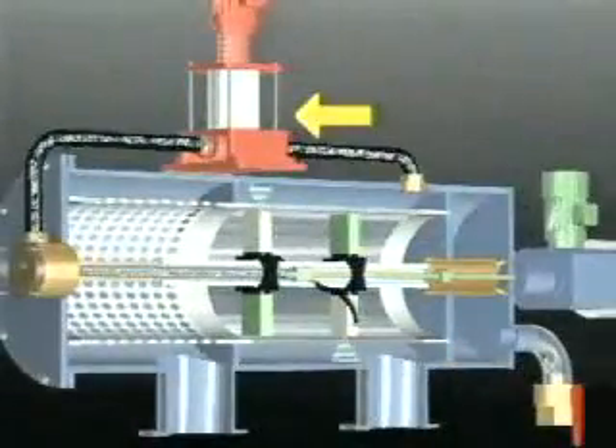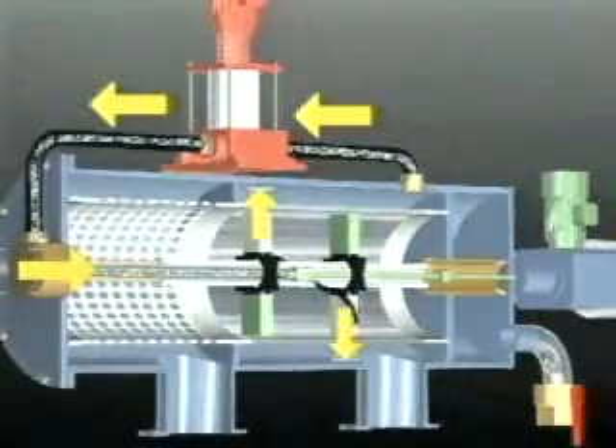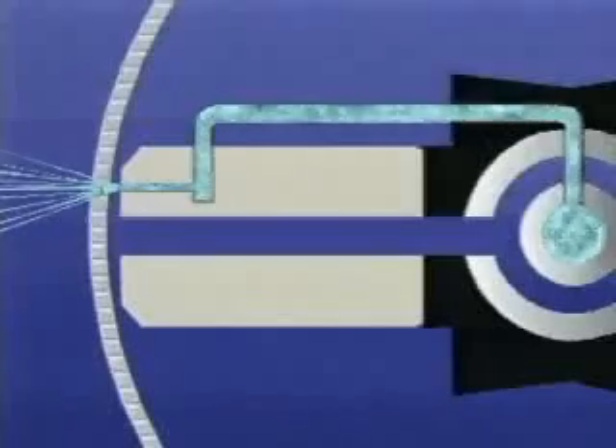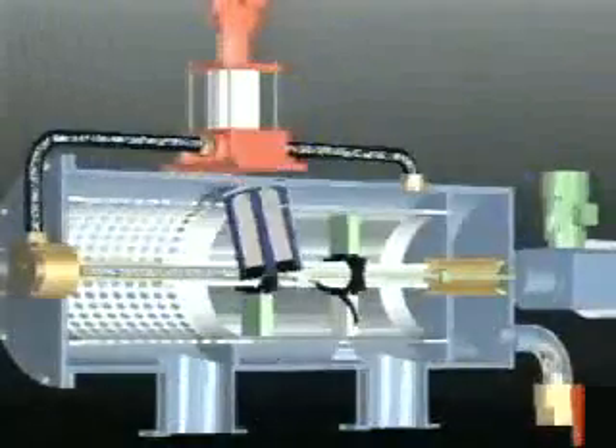A special injection pump sends pressurized filtered water through the collector's hollow shafts and into the spray nozzles, which spray it towards the screen. The high-pressure spray removes stubborn dirt particles which cannot be removed by a simple back flush stream, especially the backside cake.